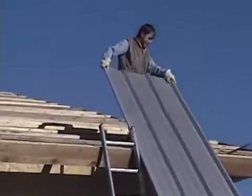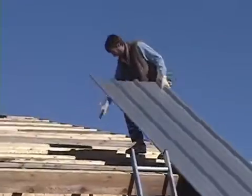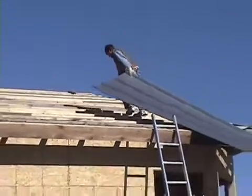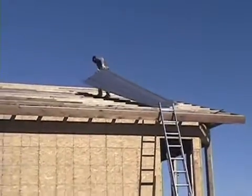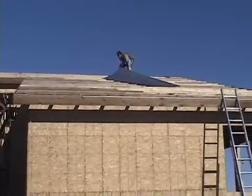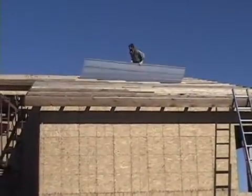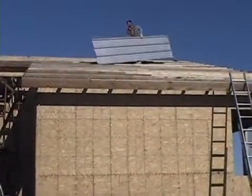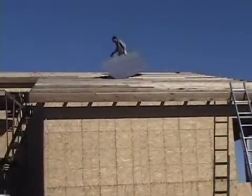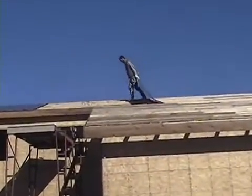I do recommend buying the strongest, thickest grade of steel that you can get, or galvalume as this is called. The stuff I put out there actually held up to tennis ball sized hail on 2 occasions, and it's a lot easier just to have a roof that can hold up to it than it is to deal with insurance adjusters later. And when you're doing the work yourself, the difference in cost just really is insignificant.